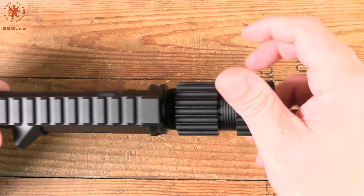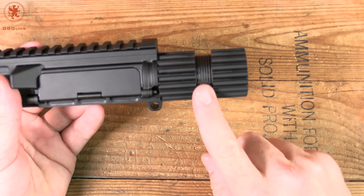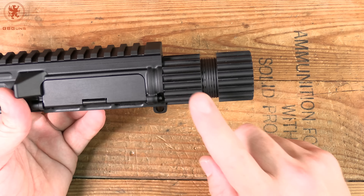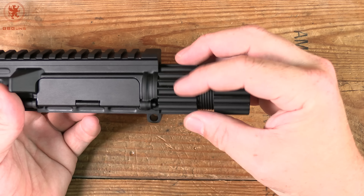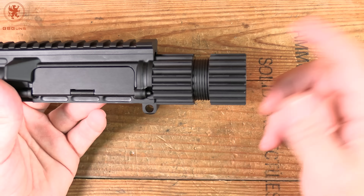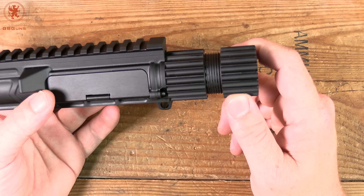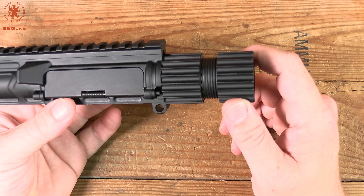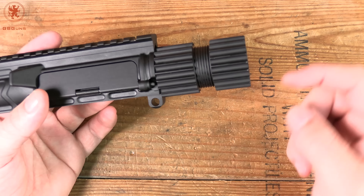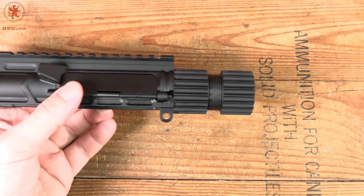When that's threaded on locking the barrel down, right here on the chamber is where all your heat is happening — that's where the worst of it is. By absorbing and shedding off a lot of that heat you're helping to keep the rest of the barrel a little bit cooler. I saw a pretty cool gun that had been sent back to POF after it had been in a house fire — of course everything was melted down and terrible looking, except for right around here, because this is the heat sink that was shedding off most of the heat.